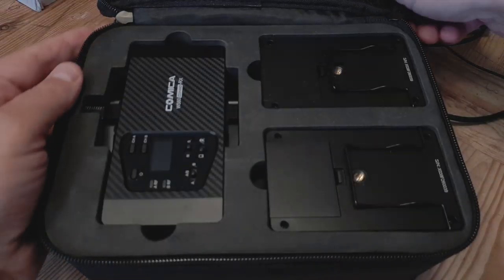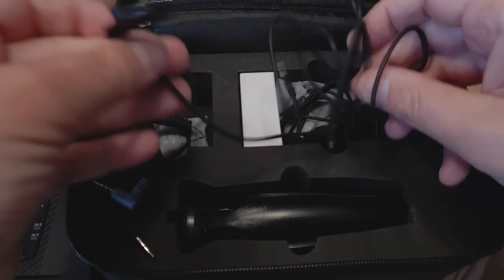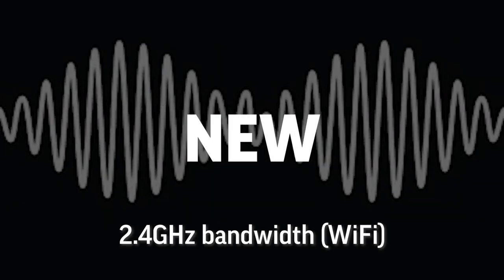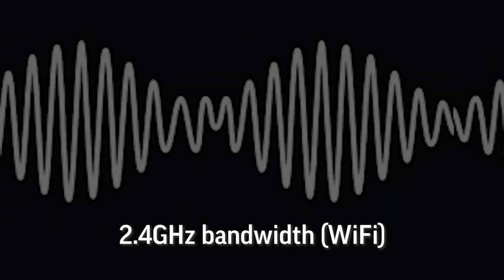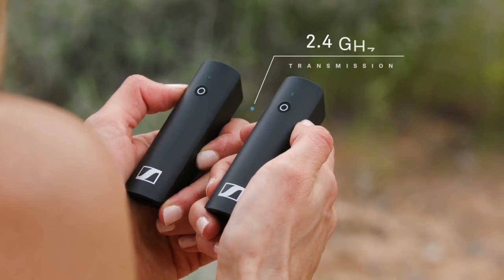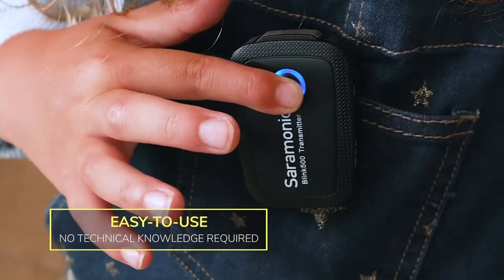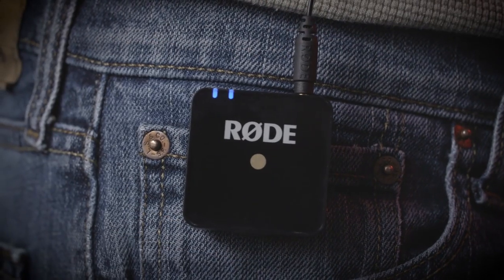You can get some great sounding wireless kits for much less. Some systems come with more than one mic or may allow you to add further mics later, while others are a single mic unit only. Traditional wireless microphones operate in the 470 to 698 MHz bandwidth, whereas new wireless microphones are coming on the market which use the 2.4GHz bandwidth — essentially Wi-Fi. 2.4GHz microphones are a great choice if you only need a few channels and like the hassle-free setup. For those who need lots of channels and ultra-low latency, UHF mics are still the best choice. These new wireless systems from makers such as Sennheiser, Rode and Saramonic generally come with a mic built into the transmitter, but there's also the option to add a clip-on mic as well.